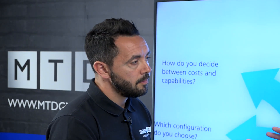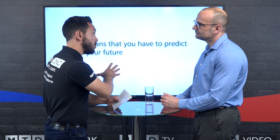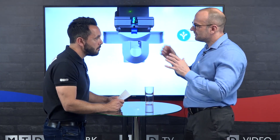Now do they come in different sizes? Yes, the Contura comes in multiple sizes. They've been designed from the ground up — what new design aspects can you tell us about? Because it's a new product there's a lot of IP in there so I can't give too many details today, but the new bearing technology being used is unlike any bearing technology used on other CMMs previously. We have something called DLC — Diamond-Like Coating — used on all of the bearing surfaces. The DLC coupled with the new bearing configuration adds to the robustness and reliability of the system.